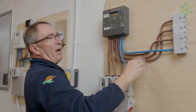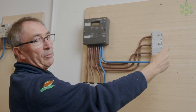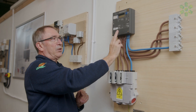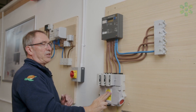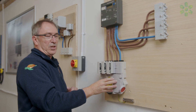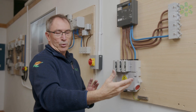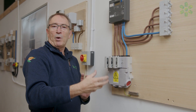That will have no detriment to the customer's motor — it will still spin in the right direction. We have to make sure that the phase rotation is correct at the meter because that can affect billing. Whatever the phase rotation is at the cutout, we can leave that — the DNO is not going to come out and change the phase rotation there. As long as we've got the correct phase rotation at the meter, when we've finished we go back to the customer's motor or lifts and check that it's going in the same direction as when we started.